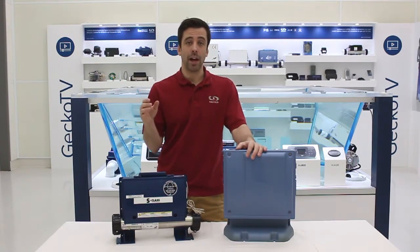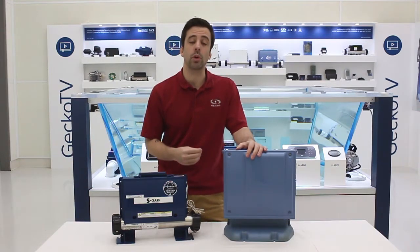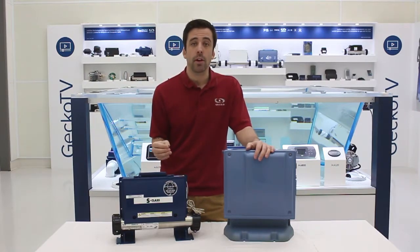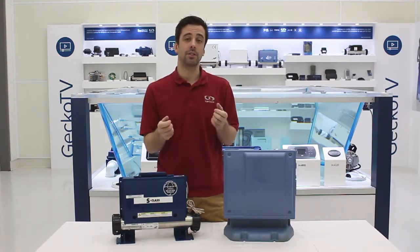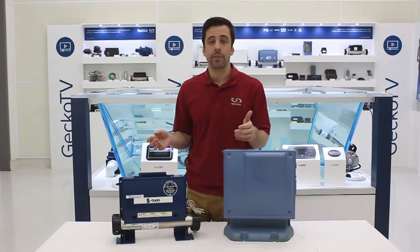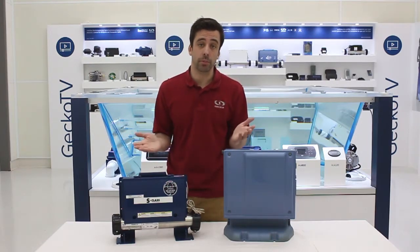So first of all, if you have a flow condition, make sure that the pump that pushes water through the heater is really working. That's the basics. If the pump is not on, very likely check the fuse, make sure that the pump is well connected and that it's receiving power. You may use a multimeter for that. If the pump is actually not working, you may just have a bad pump. That would actually solve it pretty easily.